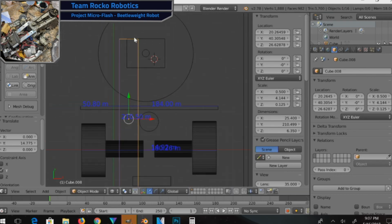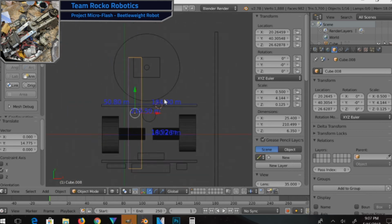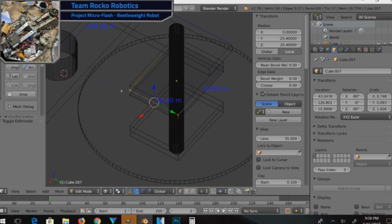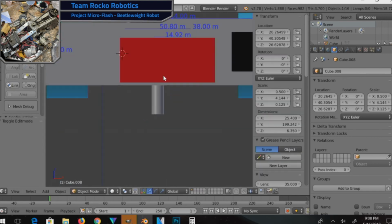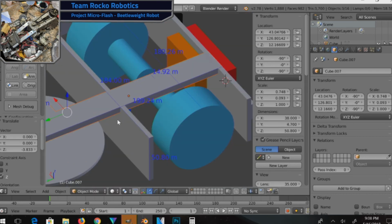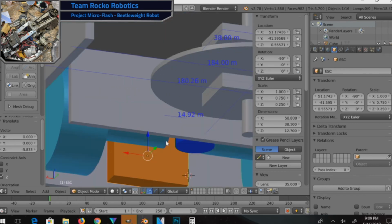What I think I also might do, though, is drill some holes in the back section to save some weight. Hopefully it doesn't compromise the structure too much. Or alternatively, one of the other ideas going on in my head right now is to make these things out of 1/8-inch thick aluminum. I'd have one piece of the 1/8-inch thick aluminum that runs the entire length of the structure, but then a second piece that runs the front half of the structure. So it basically ends up being something around 3/4 of the weight of the current piece. And that may or may not be an option.